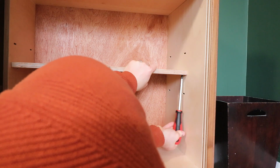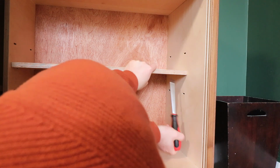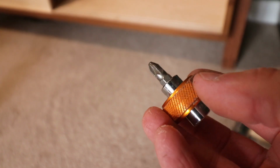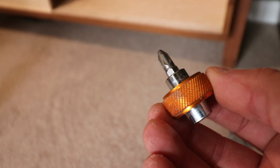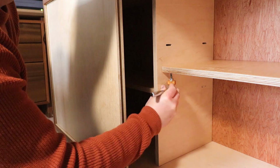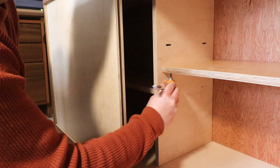I used a screwdriver to drive the screw in from underneath, which worked fine here, but in a tight situation I like to use these things. I'll leave a link to these in the description box below. You can either use them just by hand, or you can slot them into a ratcheting wrench, which makes things easier. So I think this is a really neat solution for adjustable shelves, and best of all, I didn't have to buy anything new.